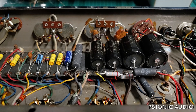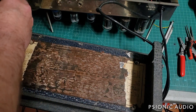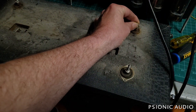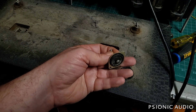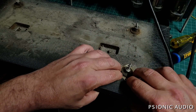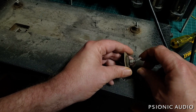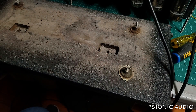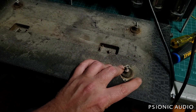That's the next thing I want to address, and one other big bugaboo: the hardware that mounts all this seems to be pretty damaged. You see all these bendy bits? That's why it's messed up — all these screws got totally bent. This is a rubber grommet; it's supposed to be sitting flat against the chassis, but the bases are actually bent. There was supposed to be another rubber grommet on top, though those are long gone, and this screw is supposed to go straight up — but it wasn't, so all of them were in here at angles.